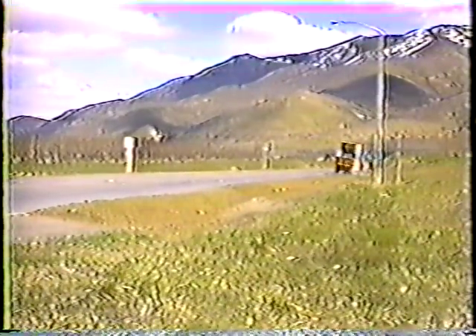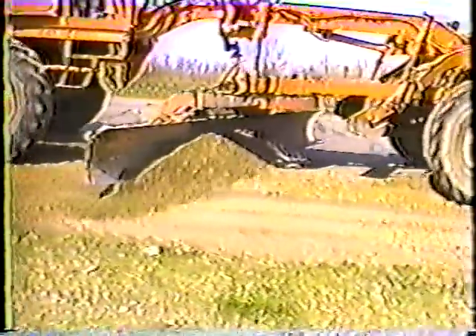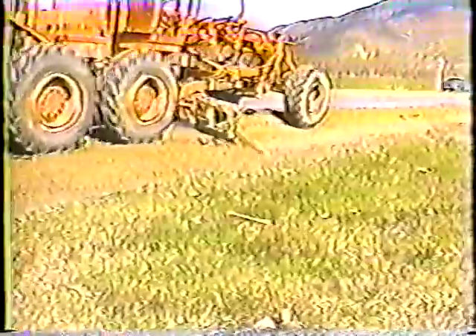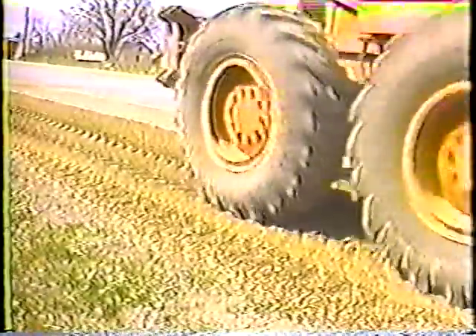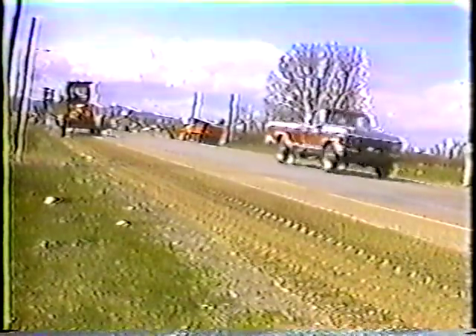This is what it should look like when you're done: a narrow windrow of material placed at the edge of the road. The next step is to spread the material back across the shoulder. Again, the wheel should follow along the edge to compact the material as you spread it. Because each previous lift of material was compacted, the shoulder should be almost flush with the pavement at this point. After the material has been spread, it has to be compacted for the full width of the shoulder. Always start at the low side and work toward the road — that way you push the material where it's needed most, at the edge.